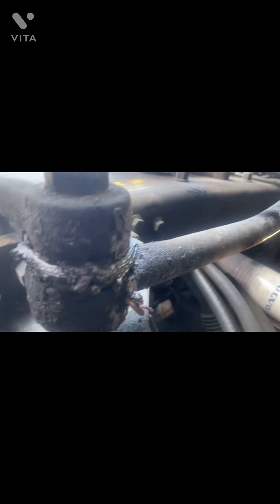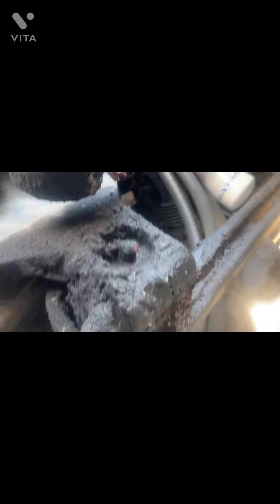This is a 2015 Volvo D13 engine. You got a bunch of easy grease fittings down here. You got a connecting rod — you got one there and that end too. You got that one, and then you got the one on the bottom. You got the one on the bottom of your slack adjuster, and then you got the one on the top of the king pin. Or you got the one on the bottom of the tie rod. And then these Volvos also have one on the spring shackle. We'll hit these real quick and we'll do the other side.